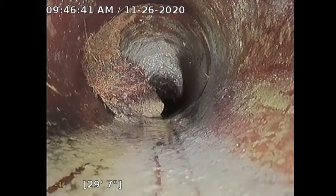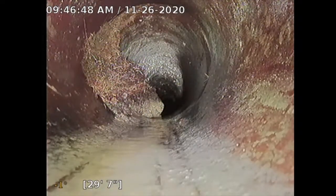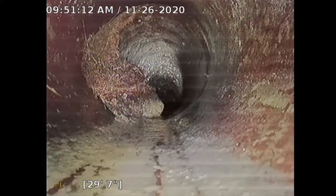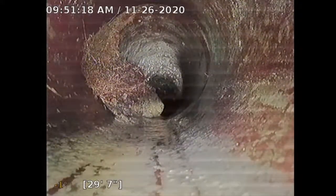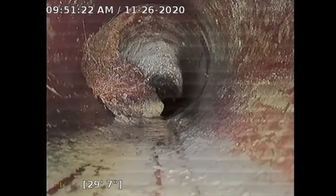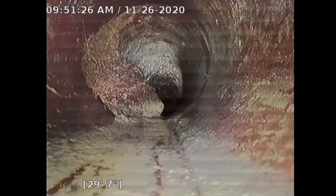This is the extent of the damage. We're at 30 feet out from the house — minus about 10 feet underneath the house, so roughly 20 feet out. I took my sonde locator out there, and it's all soil, all lawn, no concrete. There's a little patio, but we could dig under it — we don't have to cut concrete. I used my sonde and it was four feet deep in this section.